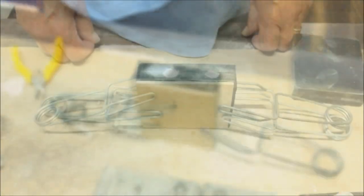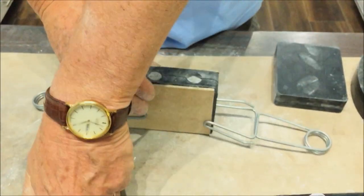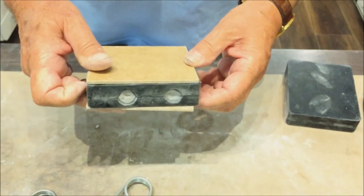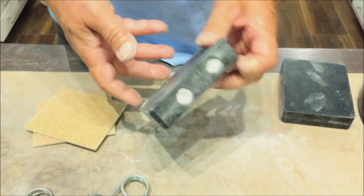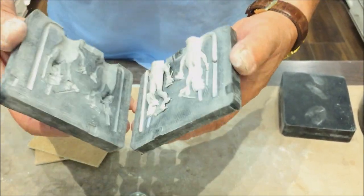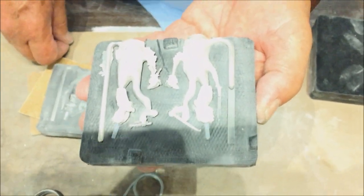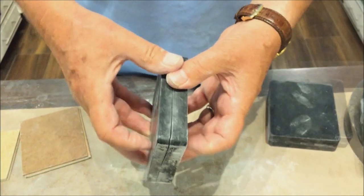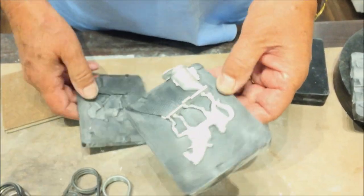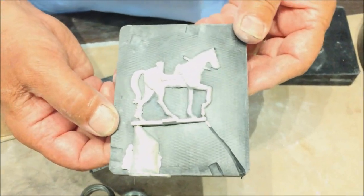Now back to your first mold — it has cooled enough to start opening it. Take the clamps and support boards off carefully. Do not touch the metal yet as it will still be quite warm. Next, slowly open the mold. Bend the rubber a little if need be to reveal the casting inside. You can also open the horse mold the same way. Do not bend the figure as it is still warm and somewhat fragile.